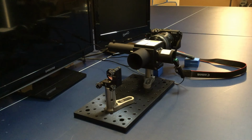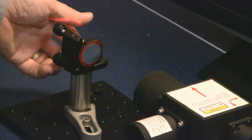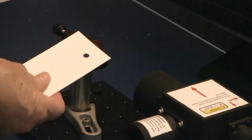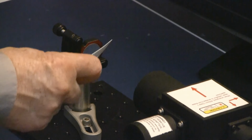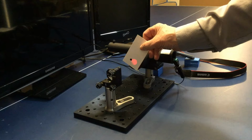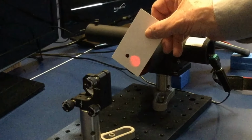Final focusing and alignment of the test mirror is accomplished by means of the 3 precision micrometer screws found on the mirror mount. Observation of the position of the beam reflected by the test mirror will be aided by use of a white business card with a 1/4-inch diameter hole punched near one end. This business card is placed over the beam exiting the SPPDI. The return beam from the test mirror can then be observed, and the position of the mirror adjusted with the precision micrometer screws.